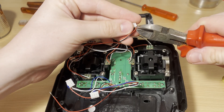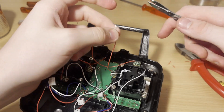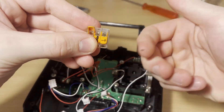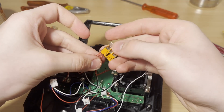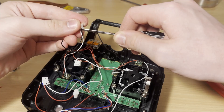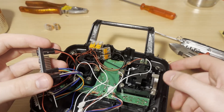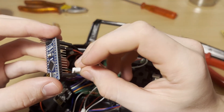So now let's start off by cutting off all the red wires for the connectors and twisting them together. For all the connecting of wires in this, I'm going to be using WAGO connectors just because of how easy they are to take on and off by opening and closing these little tabs here. But if you have other ways of connecting it, like by just twisting stuff together or soldering, that's also totally fine. Same thing for all the black wires. Now we can put the white wires from the potentiometers onto our Arduino — in this case I'm very lucky because the plugs just fit on so nicely onto the pins.